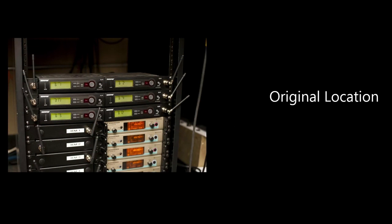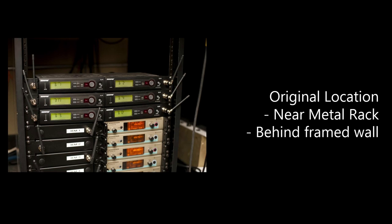The original location of the wireless receivers was directly underneath the soundboard in a rack. You can see the vertical quarter-wave antennas sitting there on the right and left side, very close to the rack mounting strip. I now actually have another piece of rack equipment placed directly on top of those receivers, which is also metal. Metal is conductive and affects how radio frequency gets into antennas. These antennas were also near a framed wall with conduit and electric going through it — about six to eight inches thick.